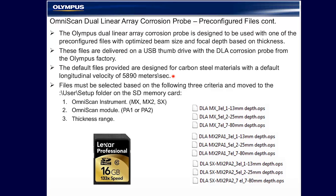The files are selected based on three criteria. First, the appropriate file depends on the OmniScan instrument — either the first generation MX, a black smaller non-touch screen OmniScan; the MX2, the blue base unit with a touch screen; or the new OmniScan SX. For the MX2, there's an additional group based on whether your module is the first generation PA1 or the second latest generation PA2.